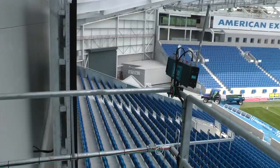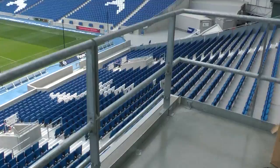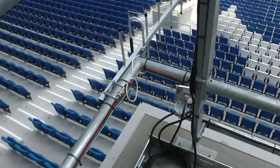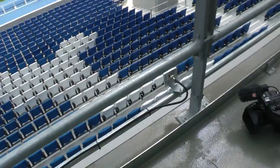That took us from a system which had two dead spots — one down the corner here along there, and another dead spot down the corner here along there — and by spreading the antennas out with separation and having that configuration in the vertical and horizontal polarizations, it has come up perfect now. We haven't had any dropout whatsoever. It just shows you need to do a bit of trial and error with the antennas and spend some time testing until you get a system that works, because it really was pretty average when we first started.